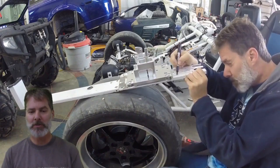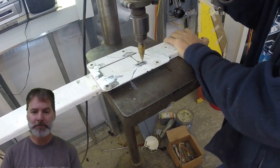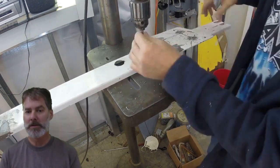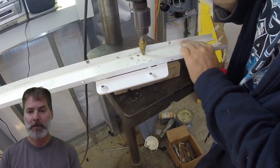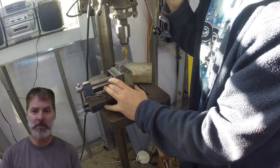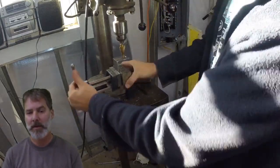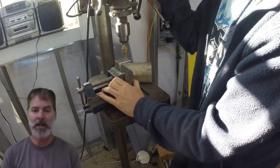There are some adjustment screws on the underside, and those screws control how much tension is on the main ball. We're making a little bit of room for them because they were hanging down below the base height. I found out later when I went to adjust them that they're pretty much flush with the base, so I could have just adjusted them all the way in instead of drilling holes right through the base plate. But now I have the option.